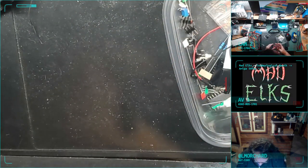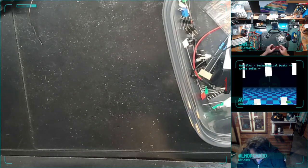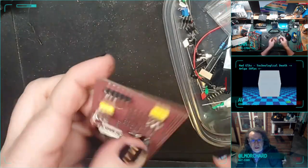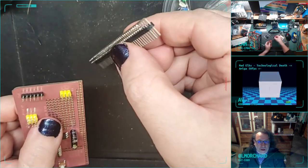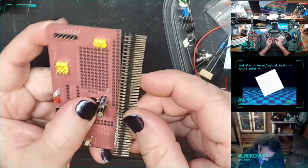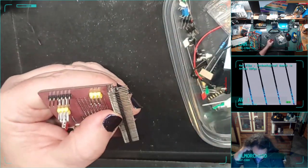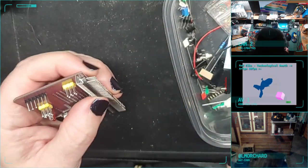Alright, I actually gotta quit out here soon. It's almost 6 p.m. my time, which means it'll be dinner time. Kinda hoping I could get the headers done on this real quick. What's funky about this is I gotta get this row of headers into these holes that don't exactly match. What I gotta do is pull out the headers that don't match up and kind of trim it. And I've done that for other boards.